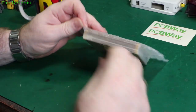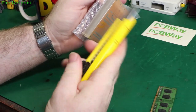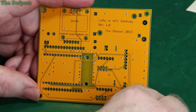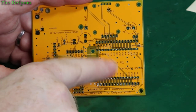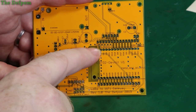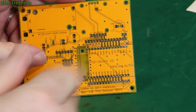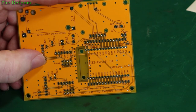Let's open these up and have a close look at them. So here's the bottom of the board, and that's the top. You can see I've done a lot of stitching around the Wi-Fi port — that's where the Wi-Fi antenna is on the ESP32. I've left that area with no fill, so there's no copper through there. You can probably see the light going through it. That at least means the Wi-Fi's got a chance to get through, and there's no reflection from it. It's spaced away a little bit anyway.